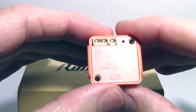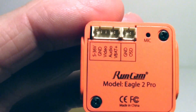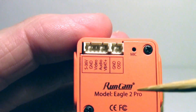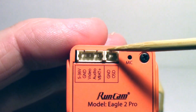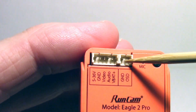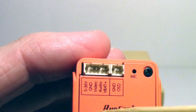There's the camera right there. Looking closely, it has the typical setup: the OSD joystick plugging into this socket here, and then a longer socket with your 5 volts, ground, and video, which you can connect a three-prong cable to.